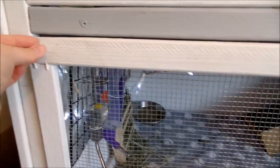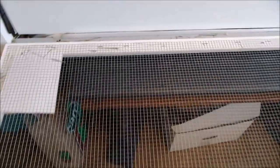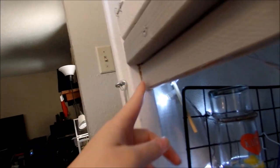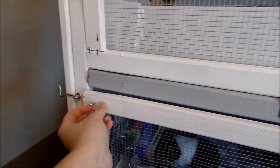For the doors, we attached them with a simple locking mechanism. The frame was staple-gunned and wood-glued together into a rectangle, then hinged to the front. For the mesh on the back of the door, we cut it to size with scissors and used the staple gun to attach it to the frame. We also used a little hot glue on the front mesh to smooth any jagged edges that could catch your shirt when cleaning. The door frame uses a 1x2 on top of the 2x2, so it fits flush and perfect.